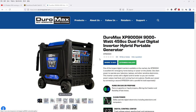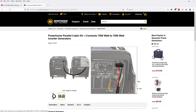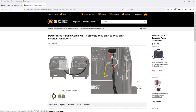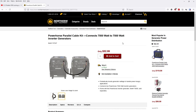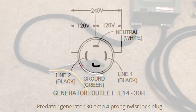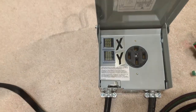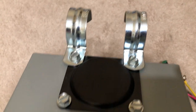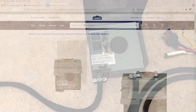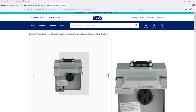The Power Horse generators are more expensive, but the idea behind theirs is they're intended to just join the generators together with a short cable — you link them and use the outlet on the generator itself. But the Harbor Freight ones only have a 30-amp plug, and I need more than 30 amps, so we have to make our own outlet between the two generators, which is what I've done here. The box is designed to be mounted on a pole — I silicone sealed the holes on the back and added conduit hooks to hang it on the generator bar. This is an RV hookup.